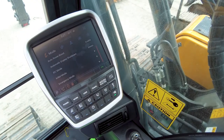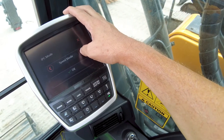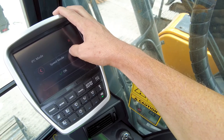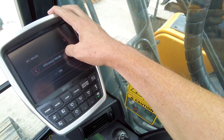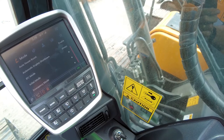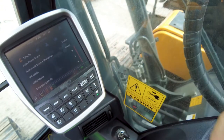Another critically important feature is a fuel-saving feature called IPC, or Intelligent Power Control. These machines come set as a default to balanced mode. As part of our PDI process here at Earthmovers Construction Equipment and our affiliates Mayer HI and Four Seasons Equipment, we set this to speed mode. There are three modes: efficiency, speed, and balanced. Speed mode is the fastest for maximum performance. If you want to save fuel you can try balanced mode, and if you want to save even more fuel you can put it into efficiency mode.